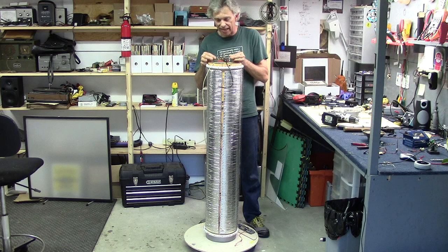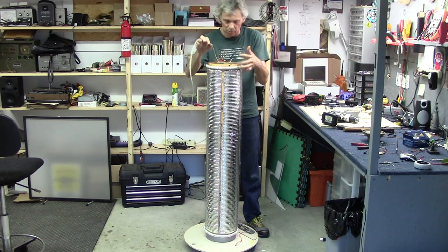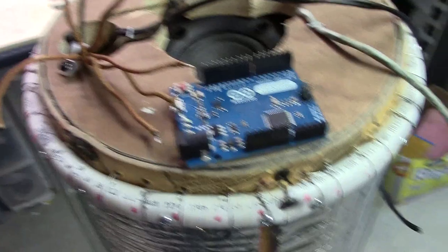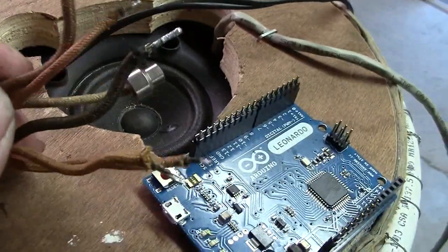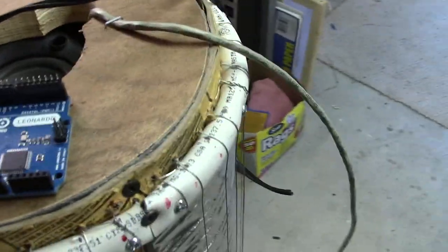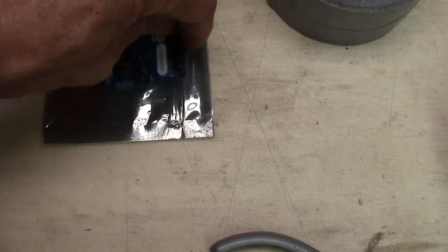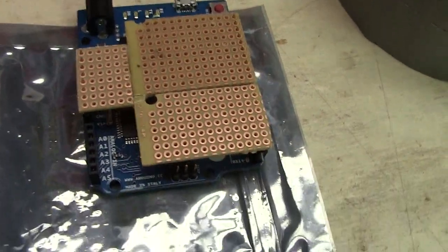The wire loom is brought up through. I've got this old-school cloth-coated wiring that's going to connect to the Arduino — that's going to be pretty cool. I've got a speaker mounted in here, the Ethernet cable connected to the sensors, all up here on top. I'm ready to put the Arduino on. The Leonardo is going to mount up right about here. This thing might end up with a couple of Arduinos. I've got some crazy ideas. Anyway, these wires will go to the microcontroller. This old cloth-coated wire — old technology meets new technology MCU. I'll have to get it nice and close to the harness. I am making a shield for it the best I can with perf board. Perf board doesn't line up perfectly if you use the small square pieces — the ones Radio Shack has.